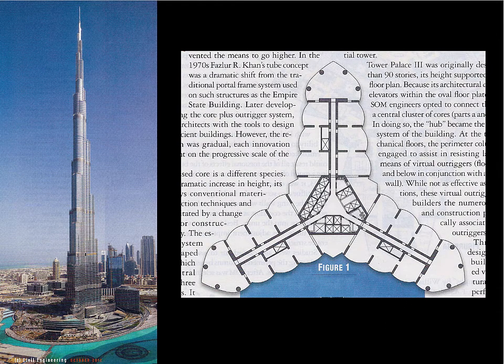And what's really nice about this is that those are not just profoundly important structural elements, but they are also really outstanding fire protection for people going into that corridor. So this is a really excellent example of shear wall stabilization of the building. And you'll notice these shear walls are coming out and engaging these walls coming off to the side. Those walls are helping to stabilize this sheet of material and that sheet of material against movement in this direction.